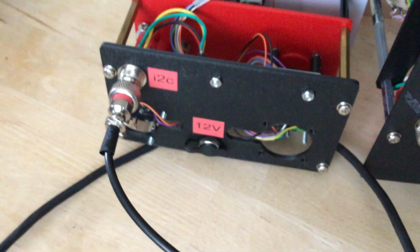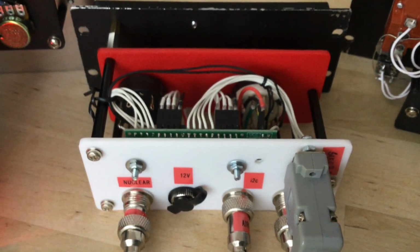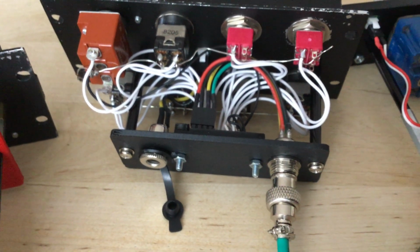Communication between the main microcontroller and all the MCP23017 is done through the I2C protocol. I2C needs just 2 input pins on the microcontroller, and this made wiring a lot easier, and the code to read the inputs of the I/O extenders is not much different than reading regular Arduino pins.